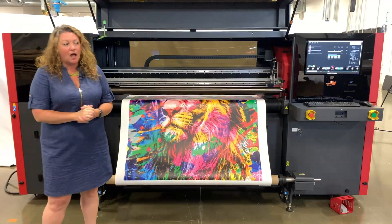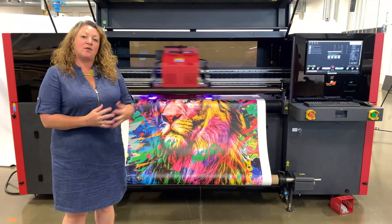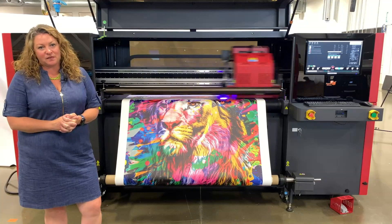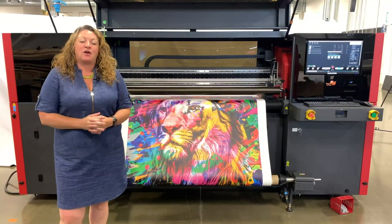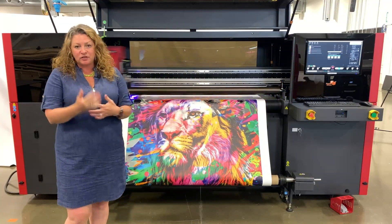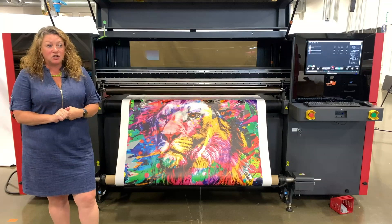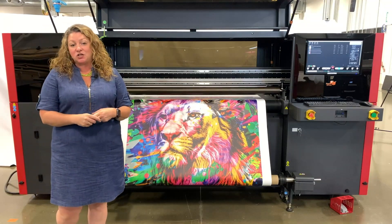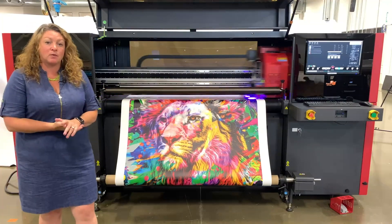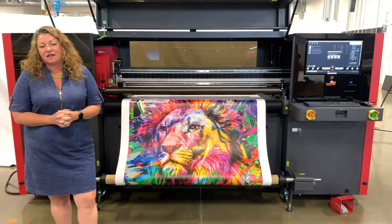But it's not just about speed and image quality. We wanted to make sure that we're putting a product out there that everyone can feel good about. So we're also now leveraging the EFI Pro Graphics Plus ink. That's giving us access to an unprecedented amount of open time, so you're able to purge significantly less, wasting significantly less ink, and you're able to do more production. With that addition to open time, we have better and improved elongation, better and improved adhesion to some of those more challenging substrates, and better and improved water resistance in submersion. All with the same familiar surface cure